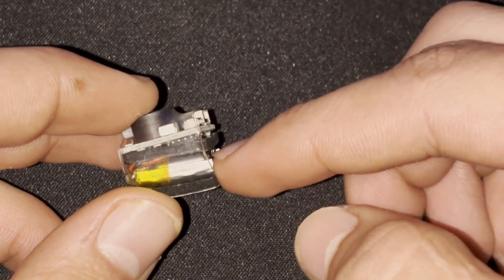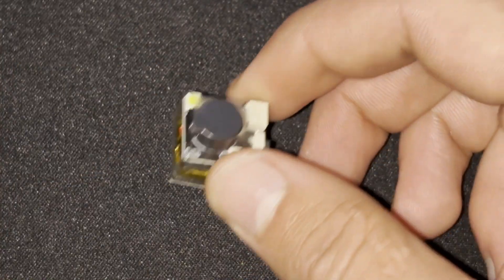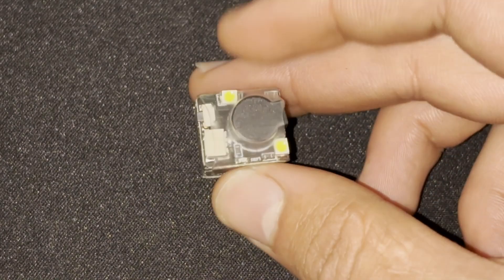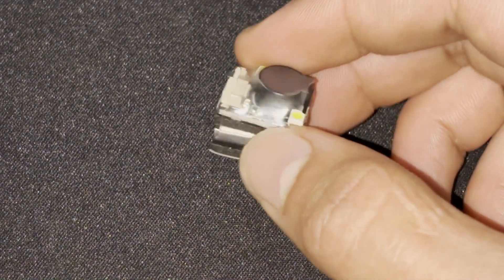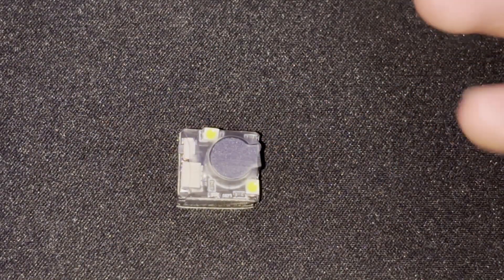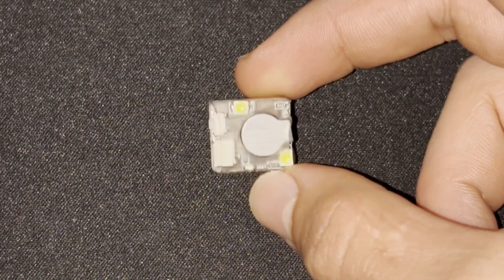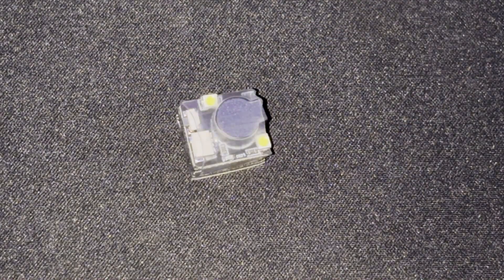You also get double-sided tape. The backup battery powers the LEDs and buzzer in the event your main battery disconnects. It should power the beeper for about 30 hours, though realistically maybe 10 hours depending on how much the lights are flashing and which model you get. You only really need about six to ten hours anyway — I don't know how long you'd search for a quad after that. Let's get into the installation.